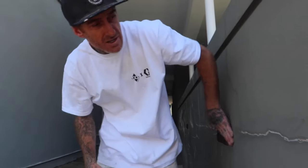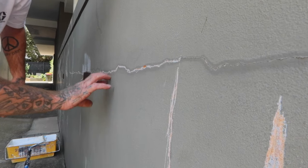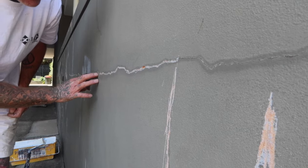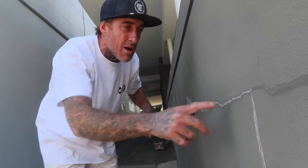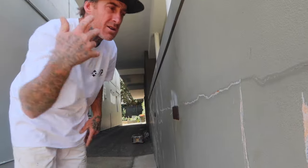So that's what we've done. Now we're going to prime it. A lot of the time you don't really have to, but I like to prime any of the bare brickwork or render. I'm using the Dulux Acratex Acra Prime. I'll go through and prime any areas quickly and show you what we're doing.